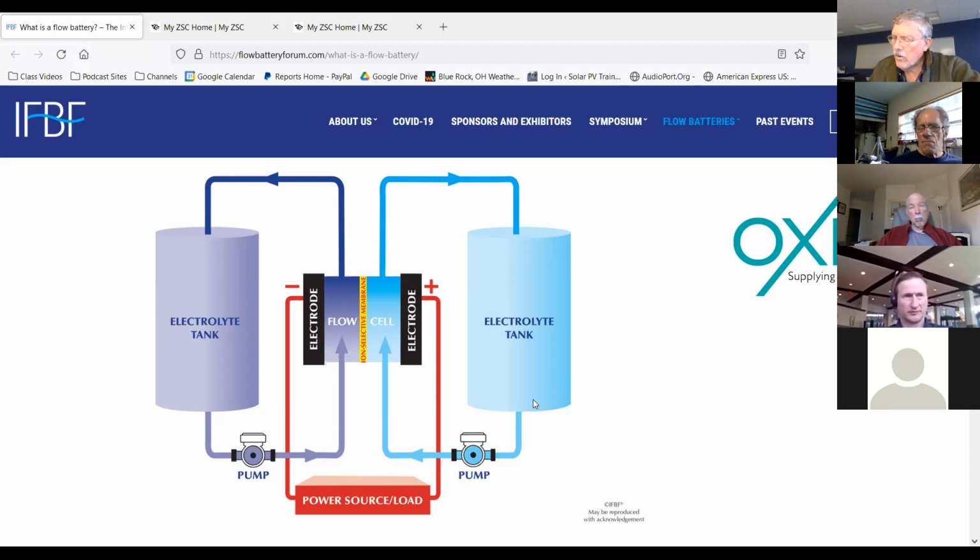The problem is it tends to have a very low energy density. So it's certainly not for an electric vehicle or something like that, or anything that requires a light mobile energy source. They do have longer durations. So they're looking at some of these. They said at a utility scale, typically utility scale lithium ion has about a 4-hour life cycle. So they are just for temporary power outages. These, at least the models today, have about a 12-hour.